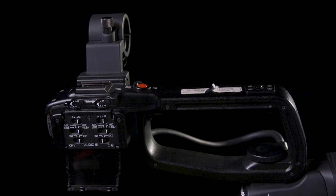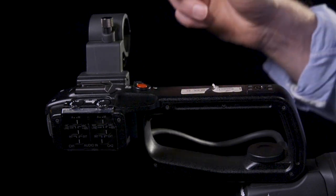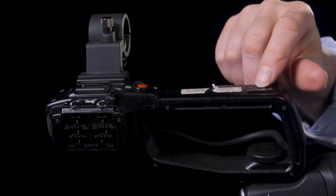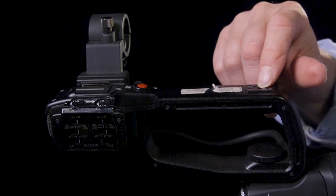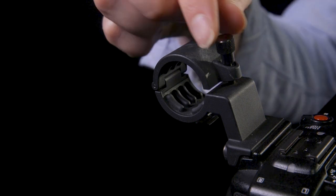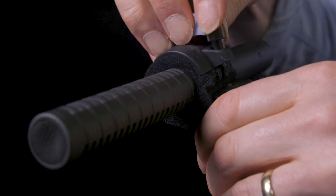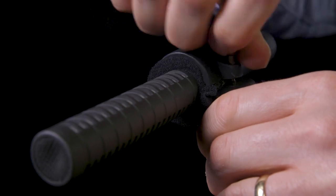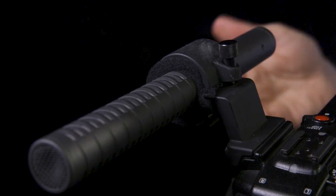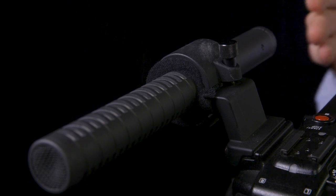These switches are handy — we can go internal or external. Internal means we're using the stereo mics from the handle, so whatever is plugged in from a boom won't work. We need to be on external to make those work. What it does mean is that we could have one microphone from a boom on channel one, and if we wanted some basic atmos we could have channel two on the internal mic, then split up the sound in Premiere or your editing system later on. When we're all set, let's close the flap. At the top we've got yet another fire button and a quarter-inch jack which we can use to plug in an Atomos recorder or a radio mic. If you want to fit a shotgun mic into the holder on top of the handle, undo the screw, open it out — the mic might need a little bit of foam packing. This is particularly useful if you're on your own without a boom operator or radio mic, as you can at least get directional sound for a simple interview.